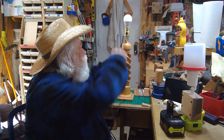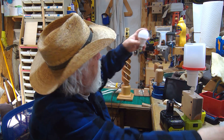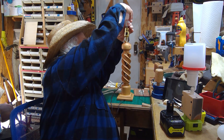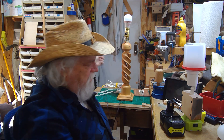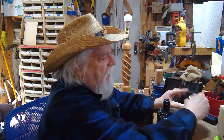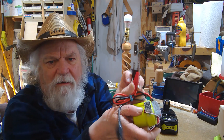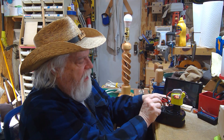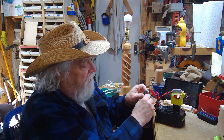Unplug it from the wall. Now take the 110-volt light out. As you can see, they look an awful lot alike — so make sure you mark these. We're going to put the DC bulb back in. Now we plug it into our battery. I have these receptacles that I've made, where I can hook up two wires to it, and I've got alligator clips on them. I now have 19 volts at my alligator clips. I could put these directly on here.